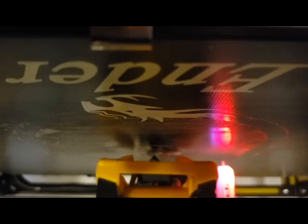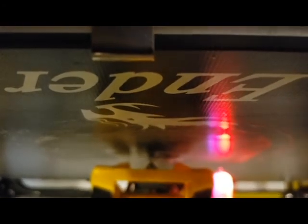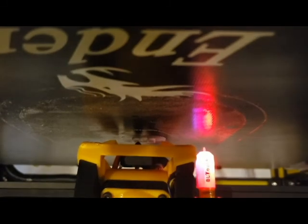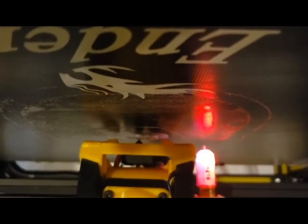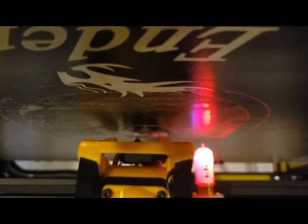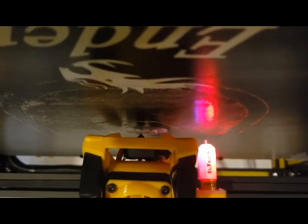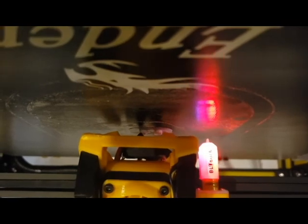And this bed temperature, this glass bed, is at 50 degrees Celsius. And that helps the sticking. You can kind of see the shadow on here, Annette. That's from the... I use glue sticks in order to get some prints to stick better. For better bed adhesion, there's some different materials where you want a layer of glue between that and the bed. It will stick way too well otherwise.